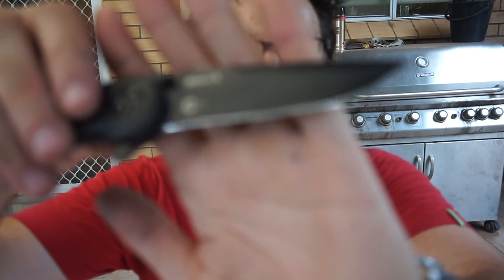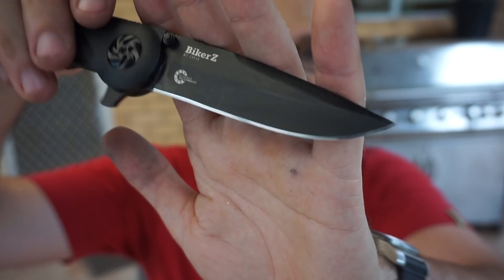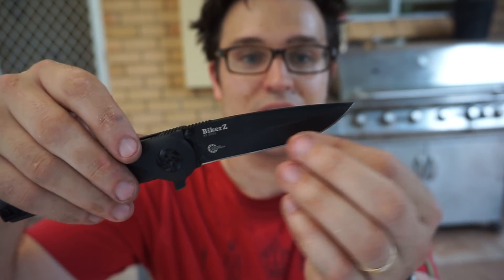Something doesn't quite seem right here. That's the second time with a 20 degree Lansky edge - in every other knife doing this exact same test, I've seen really good results on most steels. The slightest steel on my line, same rope, same board, a thicker knife really, and everything did like 180 passes with the same edge. Something's wrong here. It cuts really well on the first few and then it just kind of goes dull. You can see it's a nice edge, shiny and mirror all the way up to the apex, still very sharp down the other end where the rope's not touching, but from here onwards it's rather dull indeed.